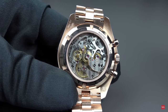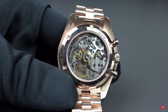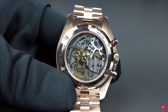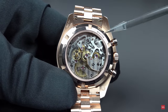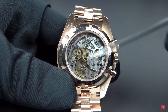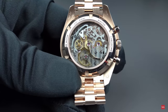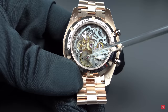To make it clear: there are not two different versions. Whether you buy the Speedmaster with the Hesalite glass or with the sapphire crystal, you get the same movement. The caliber 3861 chronograph is not a flyback and not a column wheel chronograph — the system is operated by a cam. If you want to learn more about how that cam works, please watch the steel version video where I explain the chronograph operation in detail.